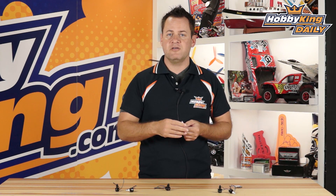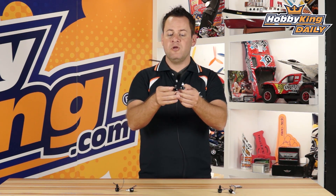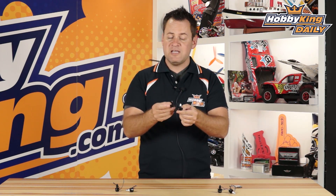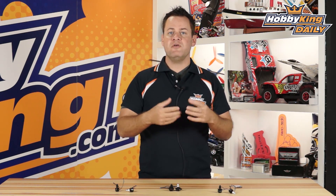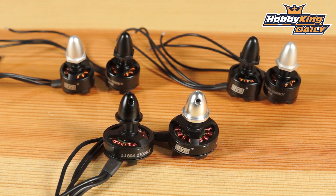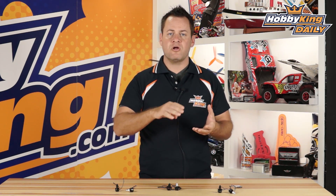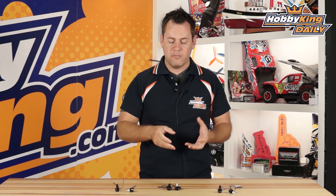At 2300 KV these things are going to be rocket ships, and you'll definitely want 10 amp ESCs with these particular motors. They come in packs of two with counterclockwise and clockwise rotation and the same mounting on the bottom. If you've got a mini hex like the Trifecta you'd want three sets; for a quad, just two sets. Each set comes with all the hardware. DYS has really balanced out the cost, performance, and overall package size — it's a really nice quality little motor. Definitely check them out if you're in the market, and as always, subscribe to our YouTube channel. We'll see you guys next time.